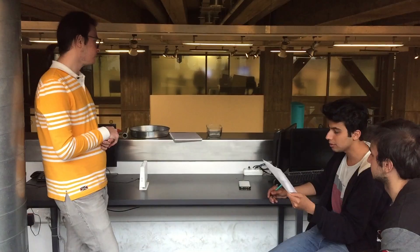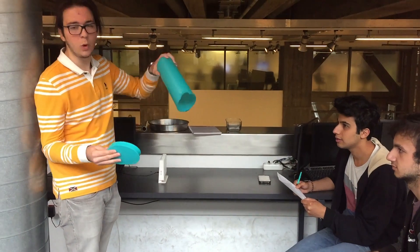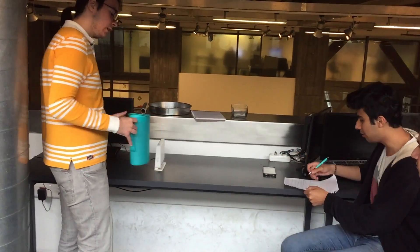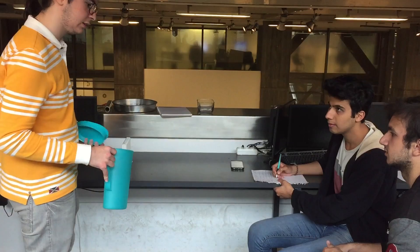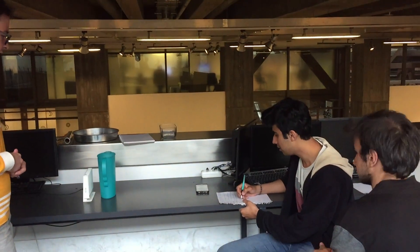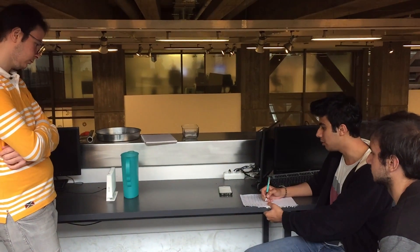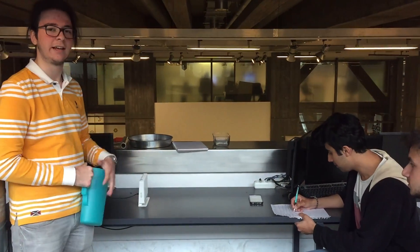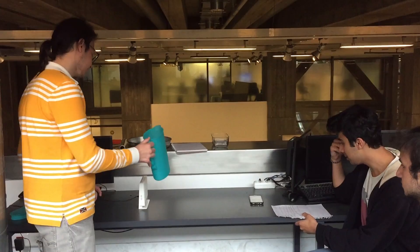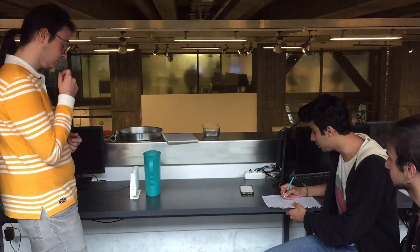Continuing with plastic to measure the Wi-Fi signal. We have a plastic water container, but without water first. We will fill it with water after this and measure it as well. I put it in front without the lid. First trial: minus 42 to minus 42 — no change. Second trial: the dBm changes from minus 42 to minus 44. We are waiting for the reset, then third trial.